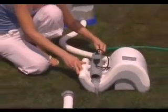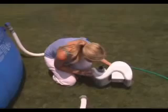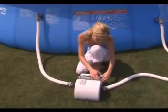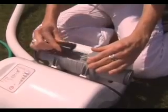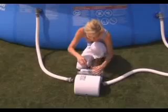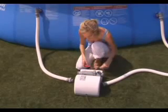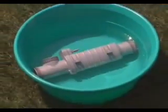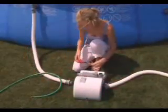A build-up on the cell indicates that there are unusually high levels of calcium in the pool. If this is not corrected, you will have to frequently check and clean the cell. If flushing does not remove the dirt from the plates, disconnect the cell from the base by removing the flow sensor, unplugging the electrolytic line and unscrewing the mounting screws. Soak the cell in a vinegar solution for 2-3 hours and again flush it with your garden hose. With the electrolytic cell cleaned, reinstall it on the chlorinator.